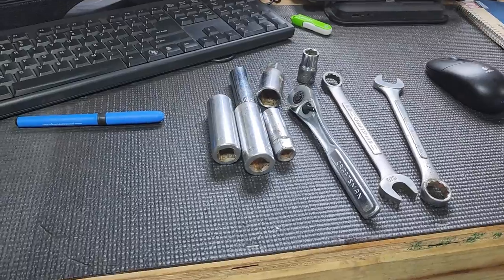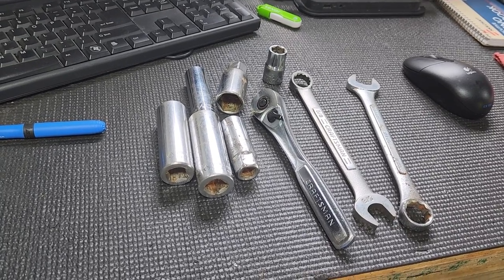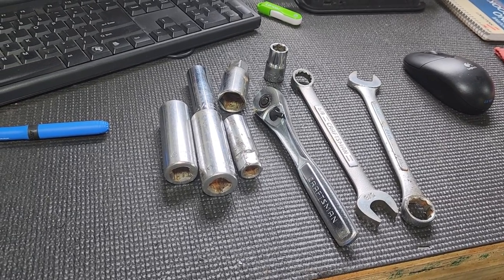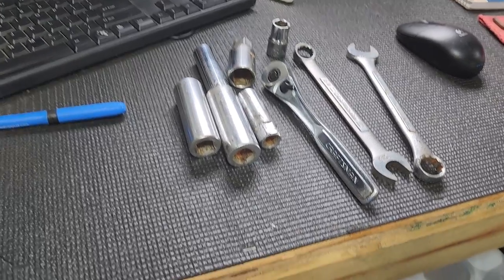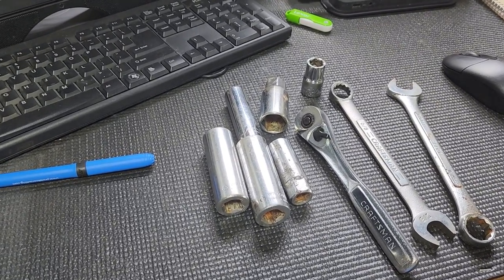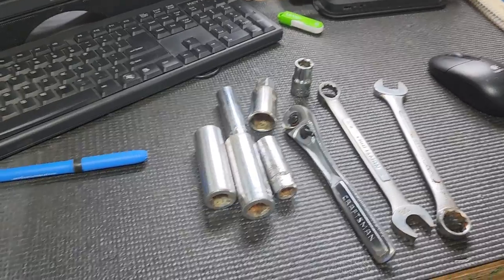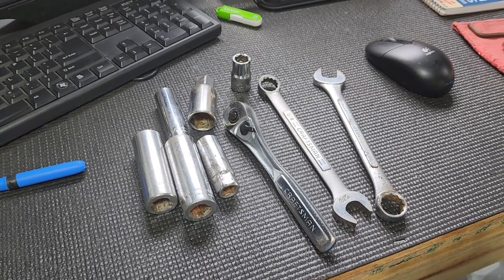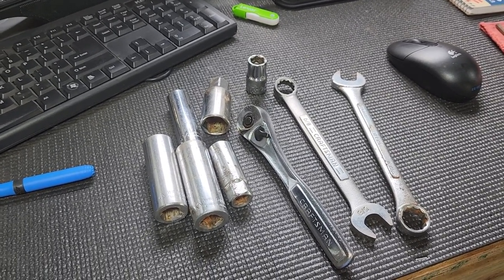What I did with these tools on the bench — I didn't video it — but these tools were completely rusted; the ratchet mechanism was locked up. They actually got wet in 2017 during a brackish/saltwater flood, so they were pretty nasty. I ran them in the ultrasonic cleaner with just simple pine sol for 30 minutes at around 70 degrees Celsius. When they came out, the ratchet was fully freed up. I did lubricate it after that, but it worked in both directions.